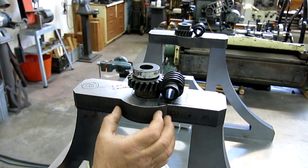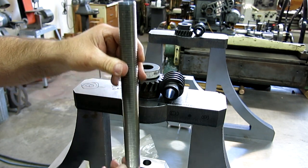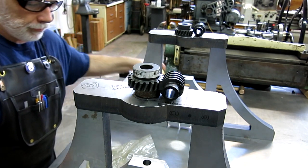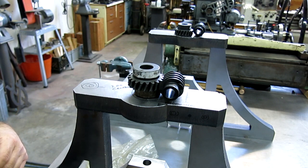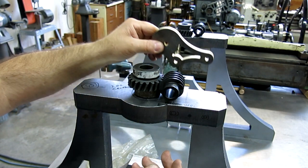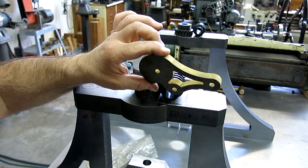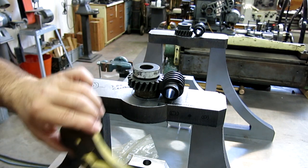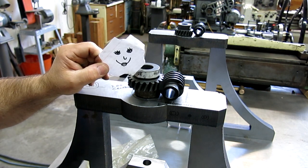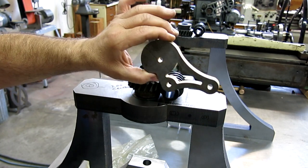This will rotate a nut that protrudes through this plate here. The screw is fixed, and the nut will rotate around it — this will raise and lower the bearing assembly. To support the worm and provide a place for the shaft, we have these bronze plates that fit in like so, with one on either side, and a common shaft will run through these. These were water jet cut — my buddy Monkey Like Shiny helped me with that. I got the bronze and he has the water jet, so somebody's happy. There was a cute little note left from my wife.